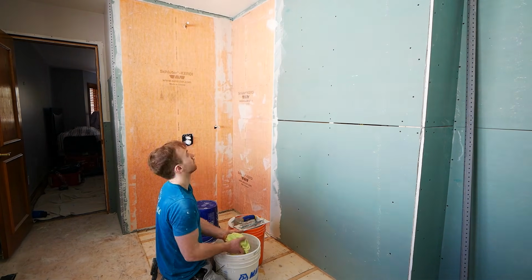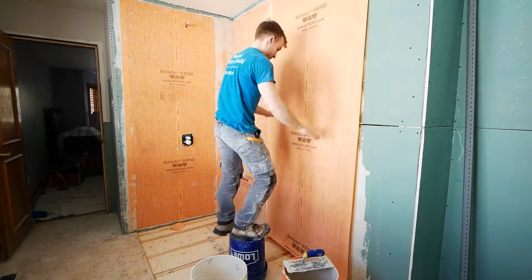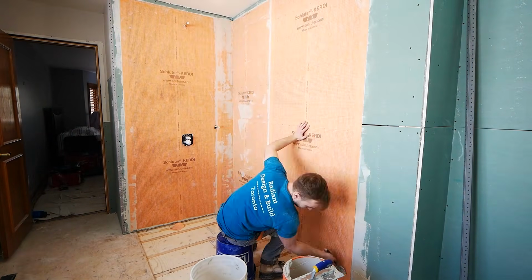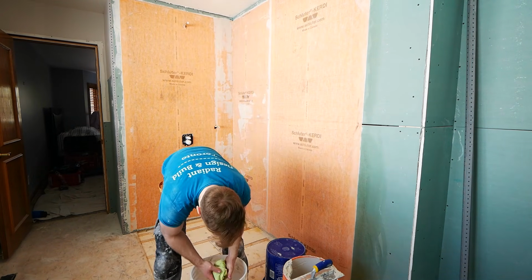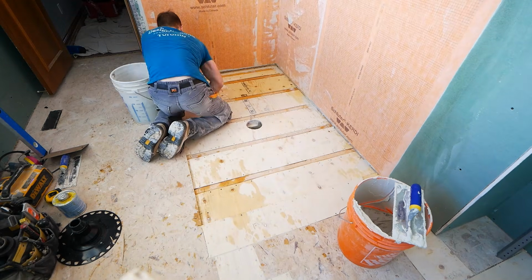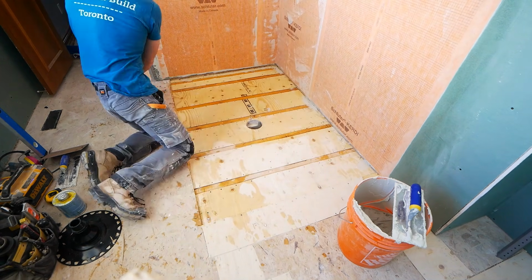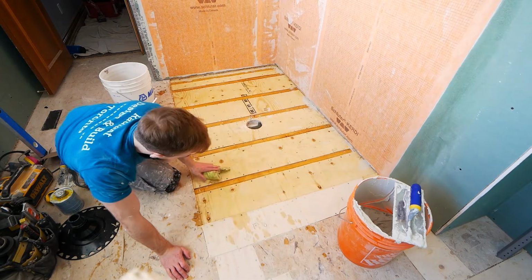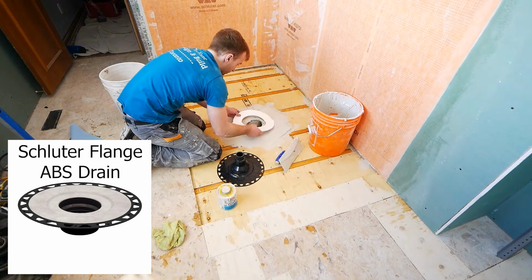But in the meantime, honestly, Schluter themselves have some great videos on this exact topic if you did want to learn that. However, there are many membranes out there, many waterproofing techniques you can use. This is just the one that I like. And for my shower floor, once I have the walls done, I'm going to saturate the subfloor to avoid it pulling any of the moisture out of the thin set itself. And then once I have that done, I'm going to insert my drain here.